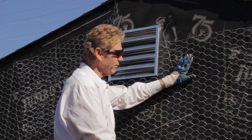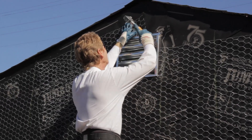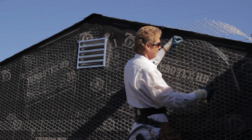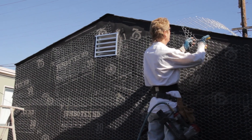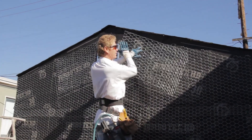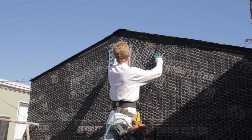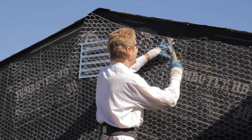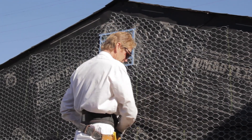While we're on the subject of wire, I'll cut this out and crisscross it the same way. This loose one I stuck under here because we want the metal to go far under there. A stud is every 16 inches. We account for his one-by-four which he's picking up right now. We take this wire — remember, the arc goes on the wall because we want it furred out. We overlap it again: better to have excess, too much overlap than not enough.